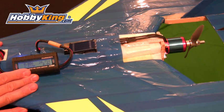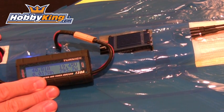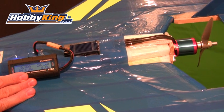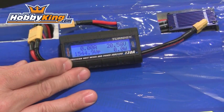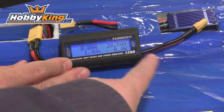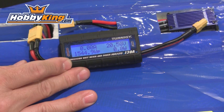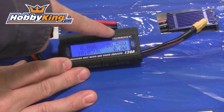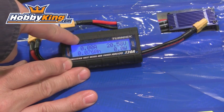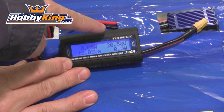Now we're going to do the actual run-up of the power system with the watt and amp meter connected. You want to do a quick test of the full range of the throttle so you get accurate readings of how the motor is performing and the batteries and the ESC. As you can see, we finished the run-up of the power system and to be safe we unplugged the power from the ESC so there's no chance the motor will spin up. As long as you leave the watt and amp meter plugged into the power source, it will save all those readings from the run-up. The top two numbers show the real-time readings while the power system is being tested — so while the engine is actually working and spinning you can see how many amps and volts it drops at each range of the throttle.